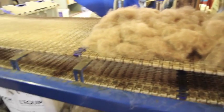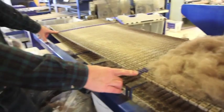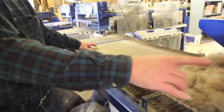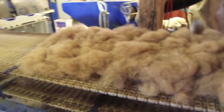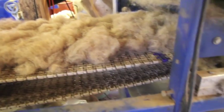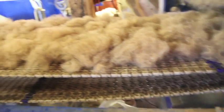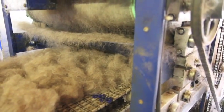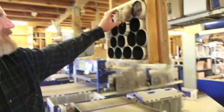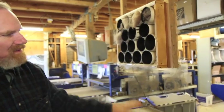We have the 2 blue lines here. Between here and here, we'll weigh out the fiber, put it in here, and spread it out evenly. So just like this. So it'll constantly feed the machine with the exact same amount. So there's blue lines there and a blue line here. So it shows where to keep feeding the feeds. So then it'll go in. The feeds, we store them up here until we get them going. And that's what these are. Each one of the feeds are ready to pull out. And then we put it down here and spread it out.